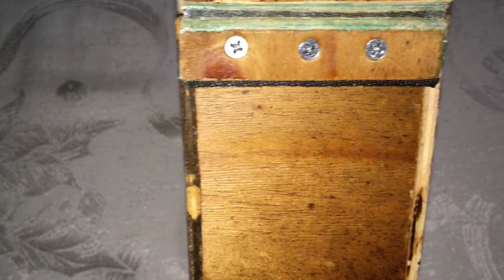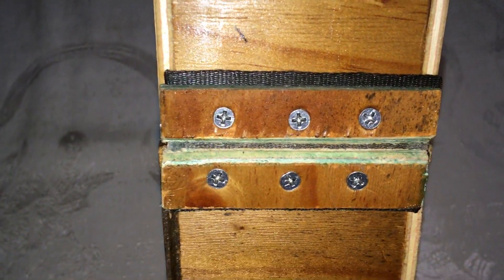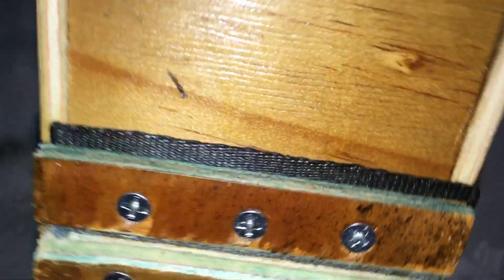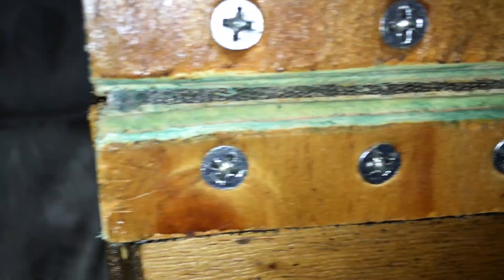The hinge is actually made from seat belt material — nylon. The key to this is when you make this hinge, you can taper the two plywood clamping parts. Make sure that when you tighten this up, the box is open so that the belt when it closes is as tight as possible. I have no looseness here to speak of.